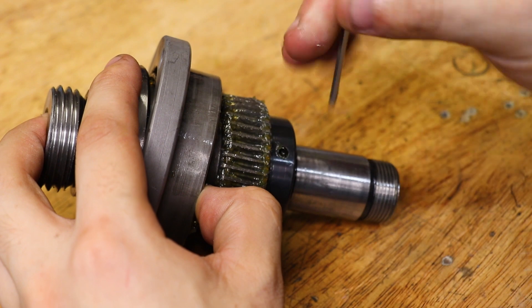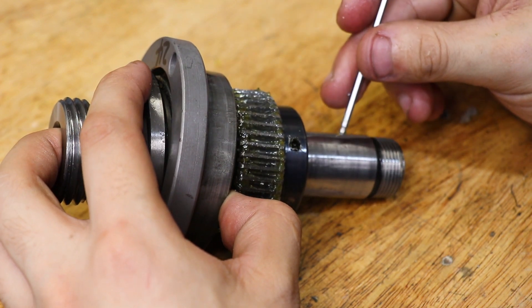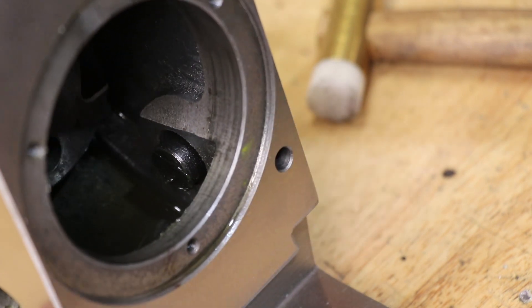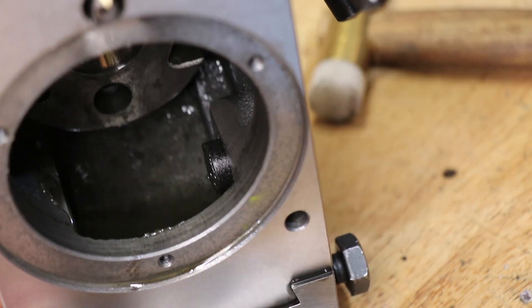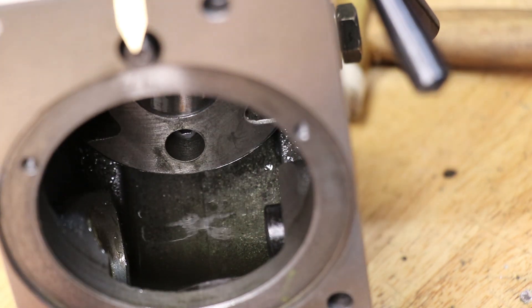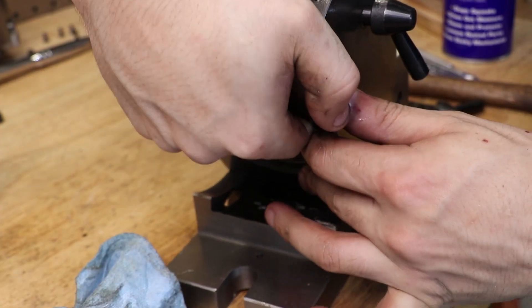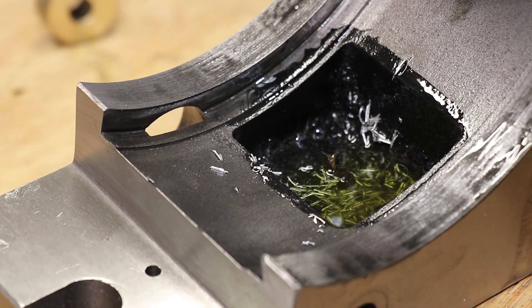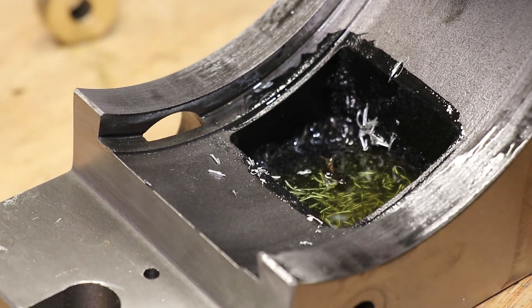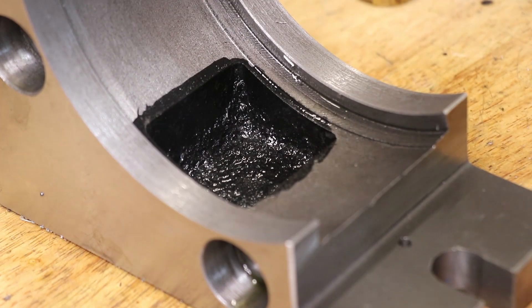I can't seem to remove the spur gear — that retaining ring appears to be held in with a grub screw and a pin which I'd have to drill out. Looking inside the housing, everything is decently machined; every surface that needs machining is machined. However, there is a large pool of oil and what looks to be metal shavings and dust inside, so I'll need to clean that out. There's also a fair amount of grabbing when I try to tilt and remove the head, and there's a big recess filled with chips and a pool of oil in the base.